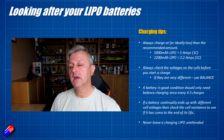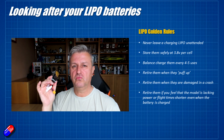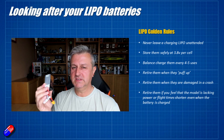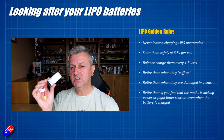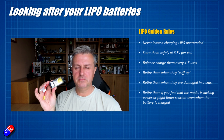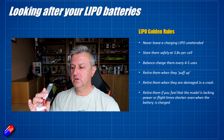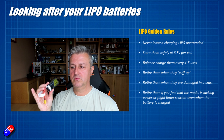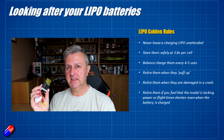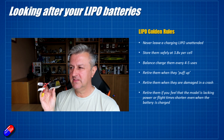To finish off, here are some quick LiPo golden rules. First, reiterate: never leave a LiPo unattended — ideally use a LiPo safe bag when charging, and always have an easy way to get them outside and store them safely. Storage charge is 3.8 volts per cell — they need to be at that level. Think about where you put them: don't put them near anything flammable. I put them in the garage in ammo boxes with the seals nicked at the top, so if one starts to gas it doesn't create a bomb but the problem is contained. Balance charge every four or five times — with good quality batteries that will be easily enough. If you always have one cell wildly out of balance, that's an indicator the battery is on its way out.